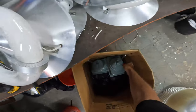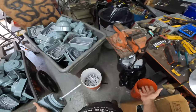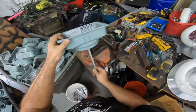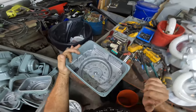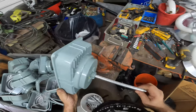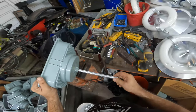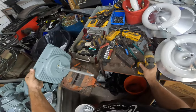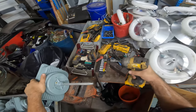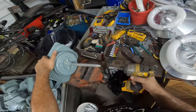Okay, so what I was doing in the beginning, and which is probably faster, was just putting this in the vise like this and physically bending it and bending it back, and the aluminum doesn't like to bend, so it comes right out. Some of these will come out pretty easily. Other ones, they're pretty much stuck. So my other easy out I use is a 3/4 that I have in my kit. The other ones I couldn't find, but then I found them in my toolbox.